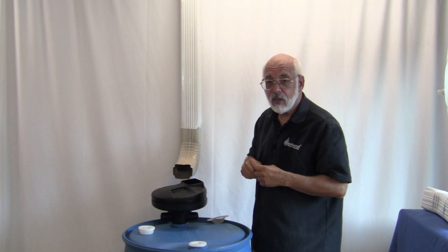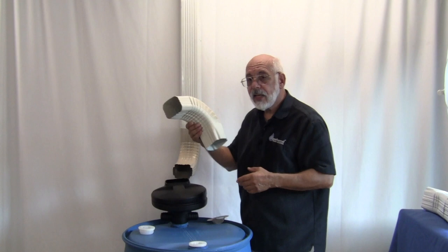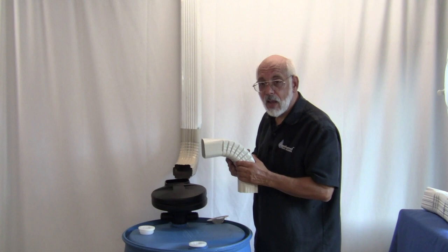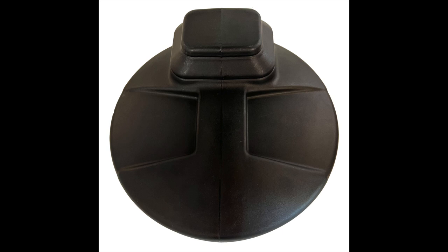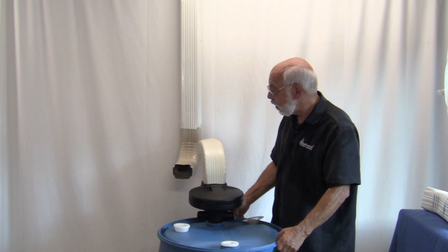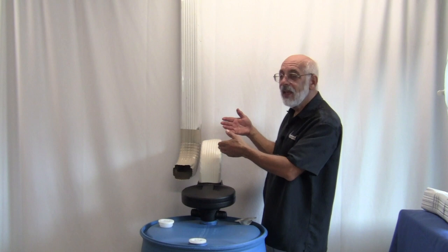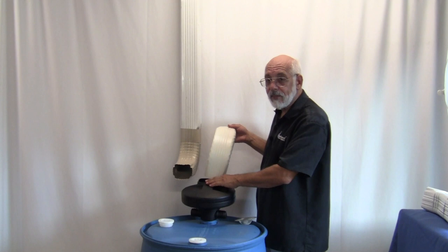Now we do have a couple of options to consider. The first is if we want to leave this enclosed — so we don't have an open situation. A 90 degree elbow, such as what I have in my hand, and we would reconfigure where the downpipes meet up. I've trimmed out the 3x4 opening in the top of this unit — there are two openings that could be trimmed out, the 2x3 and the 3x4. When doing the original install, we would configure where this elbow is meeting the other one and cut just a little bit higher. So that's one way to enclose the unit, and you would just undo the screws and move things out of the way.